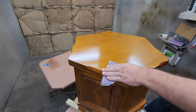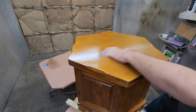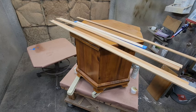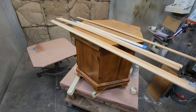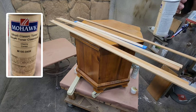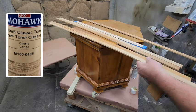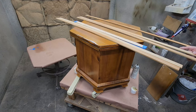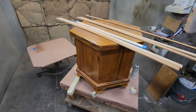What I feel I need to add is a little bit of red, but I don't want to add it everywhere — this is very uniform and it looks too uniform. So I'm going to break it up. I lightly sand the top, not for adhesion, but because I'm going to lay sticks on the top and spray my toner only in certain areas to mimic boards. This is a cherry toner — a powerful red — and I'm very lightly fogging it from far away, only toward one side of each opening to create some imbalance.